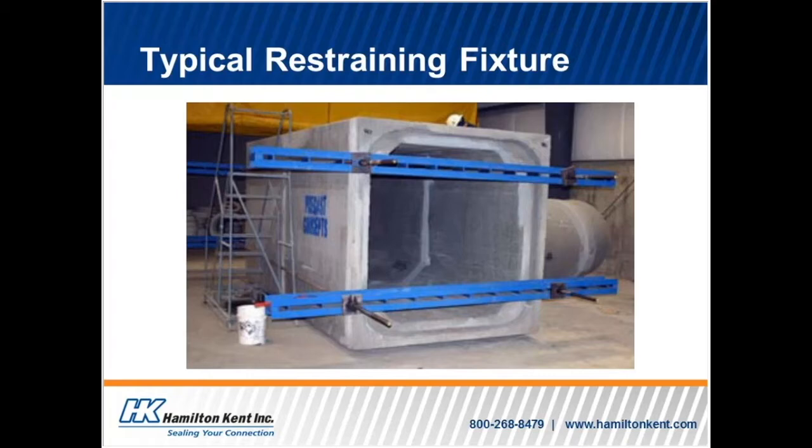This is an example of a typical restraining fixture, utilizing steel channel retaining beams and high tensile strength threaded retaining rods. Use one-inch diameter rods with washers and nuts. Rods should be about 20 feet long with 18 to 24 inches of threads on each end. If using 6-inch by 6-inch timbers for restraint, you will need at least two washers — one very large and thick, and a smaller one for each nut — and place the larger one next to the wood. Washers will otherwise eat into the wood and pressure will slowly drop because of creep. Use of metal I-beams in lieu of timbers is more expensive but eliminates concern about creep at washers.